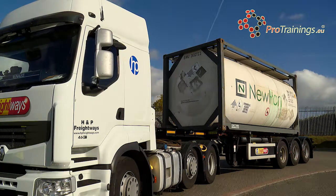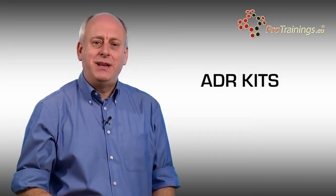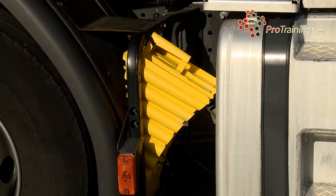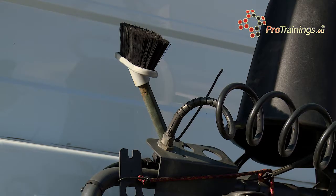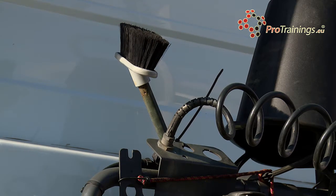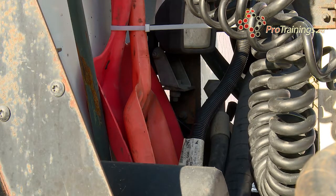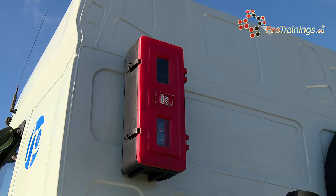Some of the large items are carried outside the vehicle. So for example, on an articulated lorry, these will be carried maybe behind the cab. The sorts of things they need to carry are wheel chocks, so they can stabilize the trailer if they need to take the front end of the lorry away and leave the trailer in place. A broom, a shovel to actually clear up any mess, particularly when you've used granules from a spill kit. A fire extinguisher in case of any risk of fire.